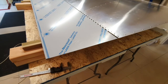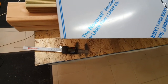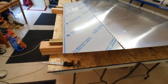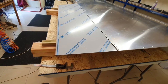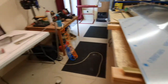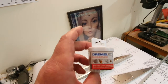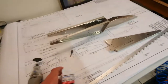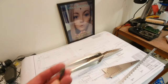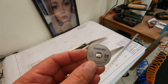The cut was made just fractionally shy of the marked line, and then it'll be cleaned up with a file. The Dremel attachment used is the Dremel EasySpeedClick system, which has a spring-loaded boss. Each disc has a specially shaped hole - you pull the spring clip back, pop the disc in, give it a 90-degree turn, and it clips in place.